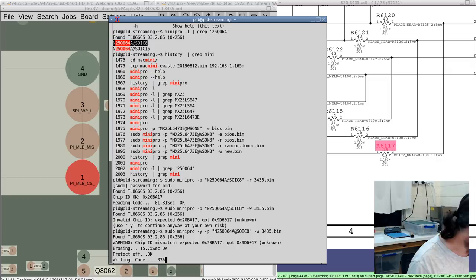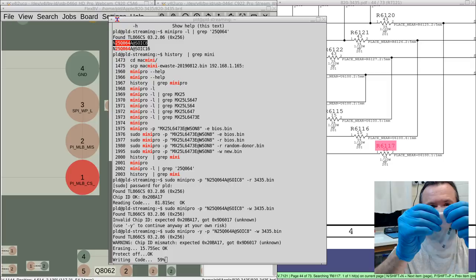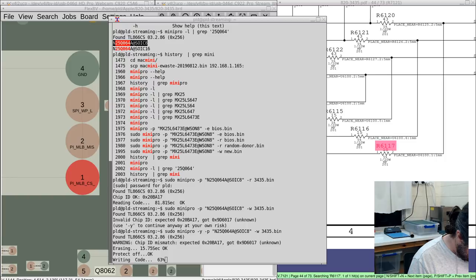Now what I will do is take the original chip, put it into the carrier. I never ever reuse the original chips. I prefer to keep them as a reference just in case things go all wrong. So just baggy that up and note down what job it's for. Throw it back with the original job parts and leave it be. Nearly done.